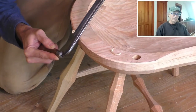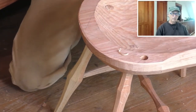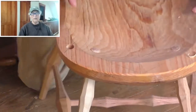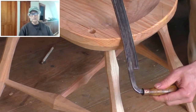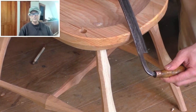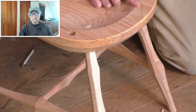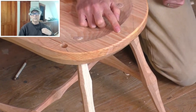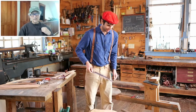You can cut it just as sweet and pretty as it can get. You can remember that move in other areas too — the draw knife is a wonderful end-grain tool. With that bevel up, the flat back tracks and enables you. Do you see it doing that, Alia? Yeah, I do. It's great. I never would have thought of doing that, though I do remember you telling me to do this with the draw knife once when we were at your shop. I tried it and it ate me up, but it's working out pretty good now.